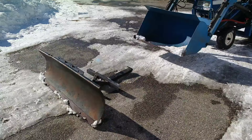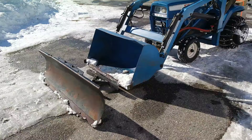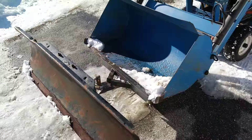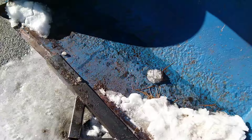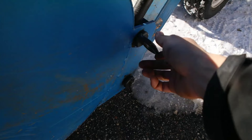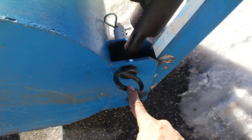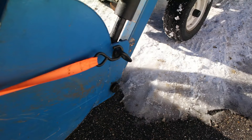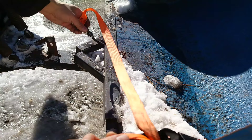I'm going to show you how it installs right now. As you can see, that was easy. After I install it onto the cutting edge of the bucket, I'm just going to inch this over to center it. And now I'm going to add two ratchet straps — from this point to this little clevis pin ring I have on here that holds my bucket to the loader arms — ratchet strap from here to the plow, and again on the other side. That's going to help keep my plow centered and on the cutting edge as I plow.